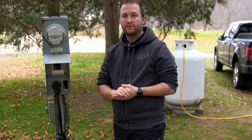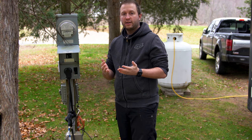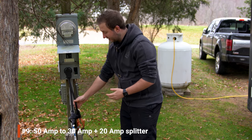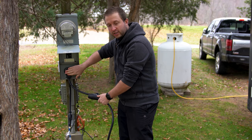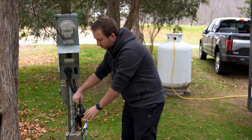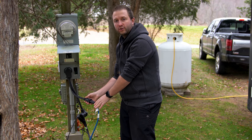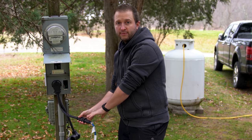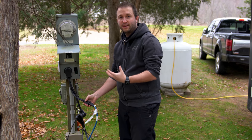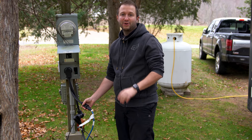The second big advantage is that a 50-amp connection is actually two 50-amp hot legs giving 100 amps total. Since our RV can only use 30 amps, we use a splitter that splits the 50-amp connection into two: one is our 30-amp cable powering the RV as normal, and the other is a 20-amp hookup on a 12-gauge extension cord used to power the heated hoses. This means whatever power the heated hoses draw won't come off the 30 amps available to the RV, leaving us the full 30 amps for everything else inside.